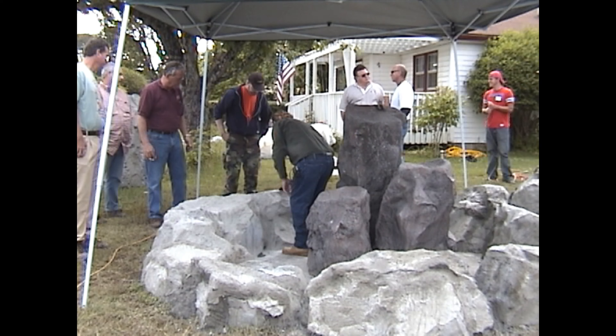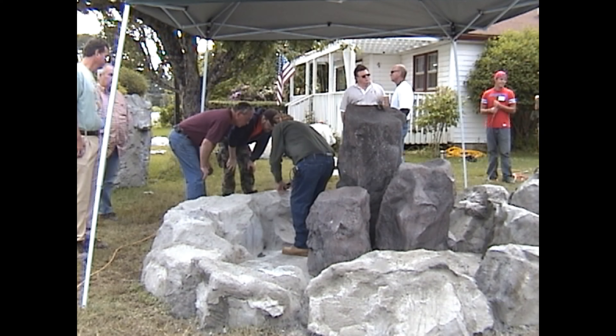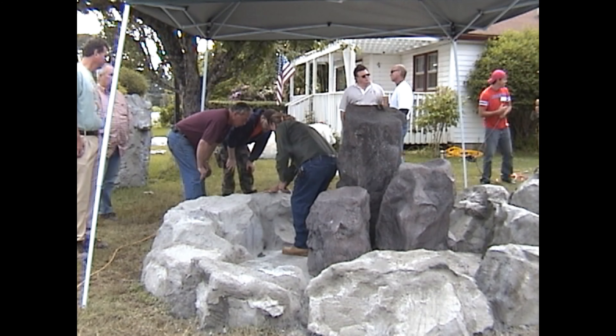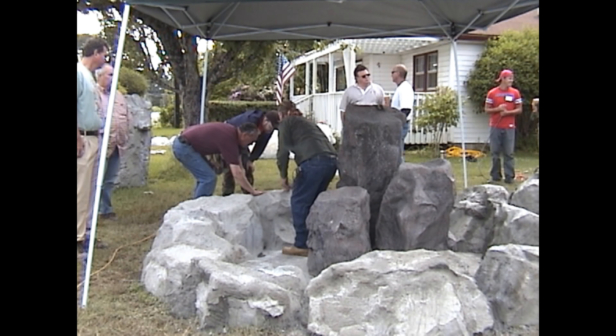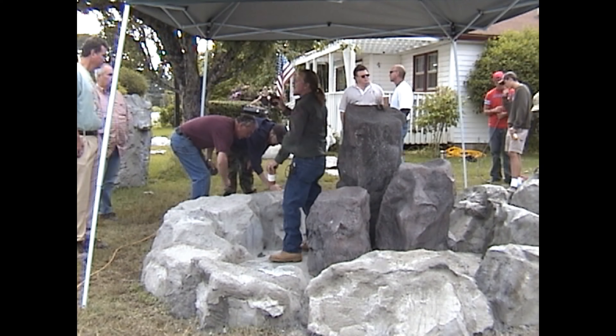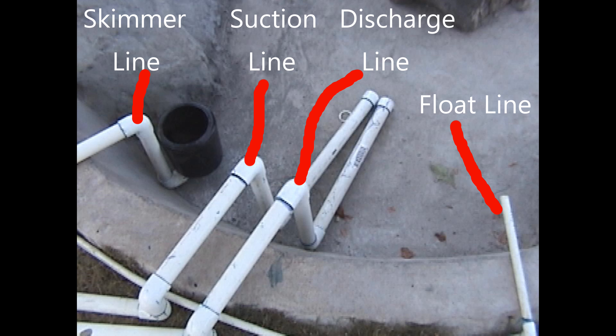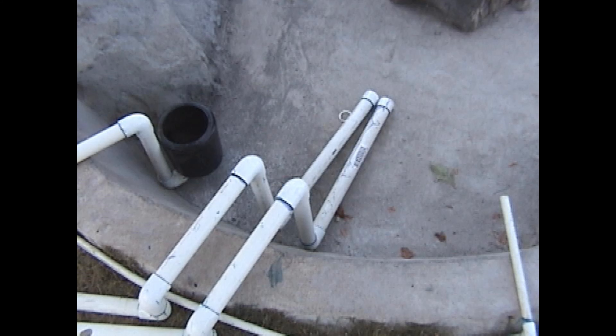At this point, all the rocks were complete, with the one exception of all the removable rocks that would cover the plumbing that we would still need to install. The plumbing that we're installing is actually behind these bubbler rocks on the bond beam. In this clip, we have laid the plumbing out for where the skimmer canister will be placed. We have also placed the suction line for the pump, the discharge line for the pump, and the water supply line for the autofill water leveler float valve.